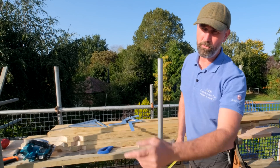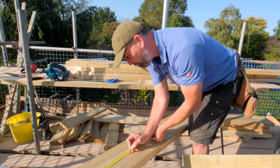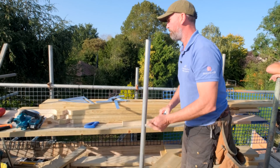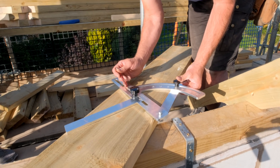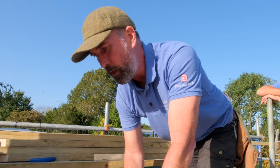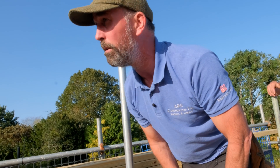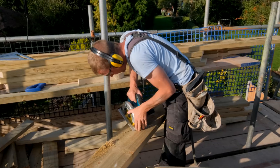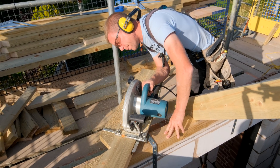I always set hips out the same as Dan — basically we go from the longest point of the hip. I'm at the longest point here Tony, and I'm going to pivot it slightly. The measurement I need is 2435mm. I'll mark it like this, doing a bit of an arc — see it like that. I'll get the square down and I need to make sure that arc falls right into the corner. I slide it along until this corner is into the arc. See there — how spot on is that! That's why I like this square — it's a lot easier than marking everything out with speed squares. It's a big bird's mouth, so that's all going to come out there like that.